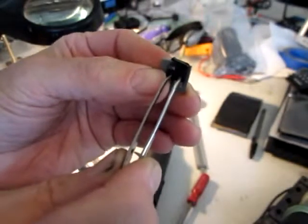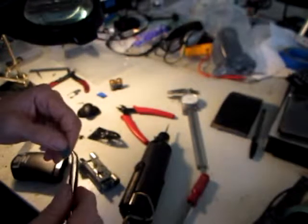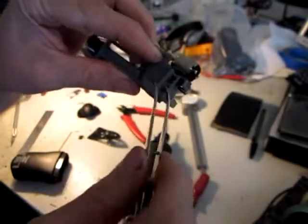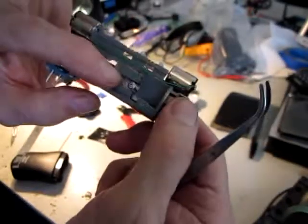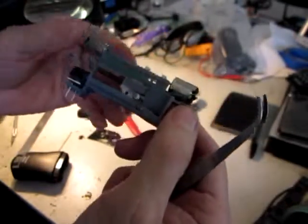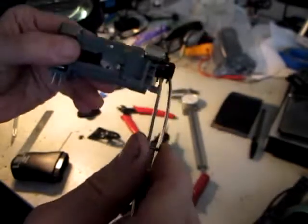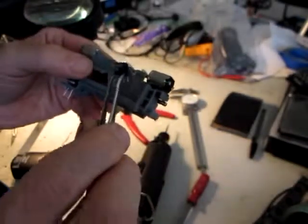Just in the upper right corner. When it's all ready to go and the wires have been soldered to the terminals, it's then going to be laid right back in place, just like that. That will hold the microswitch in place so that when this brass and screw come down, it makes that switch and will stop the motor. I'm going to solder up the wires on the micros, do all the gluing, and then get back to you with further improvements.